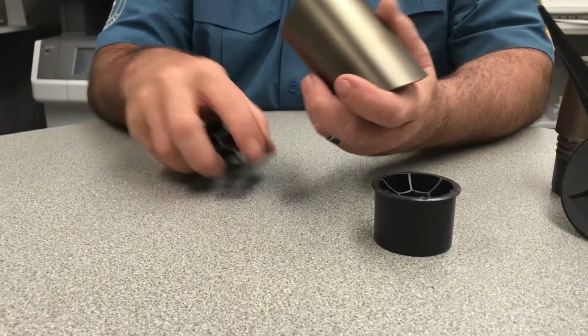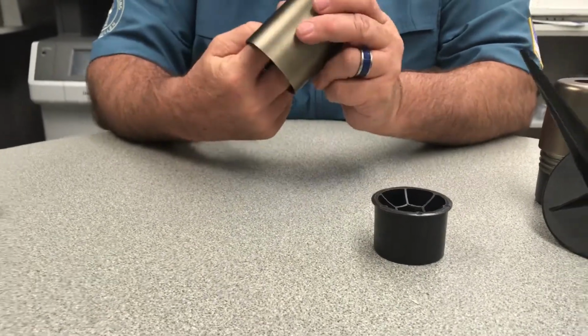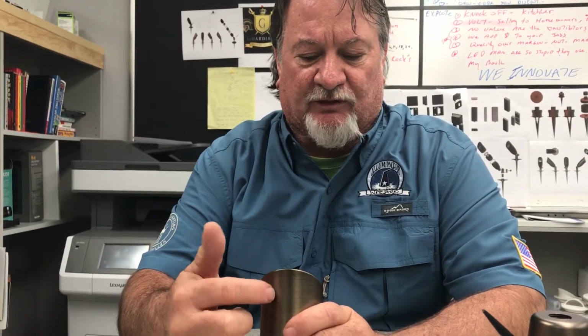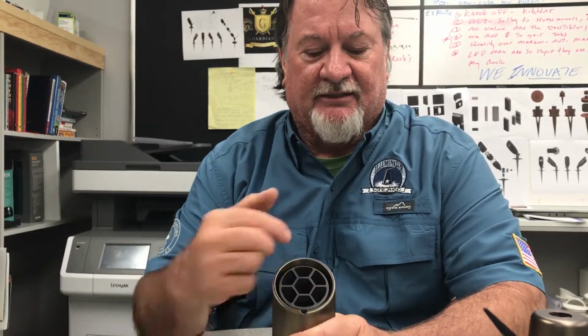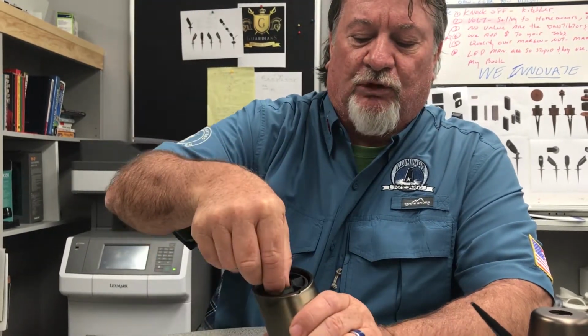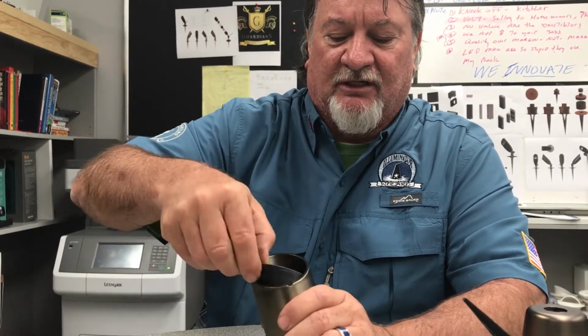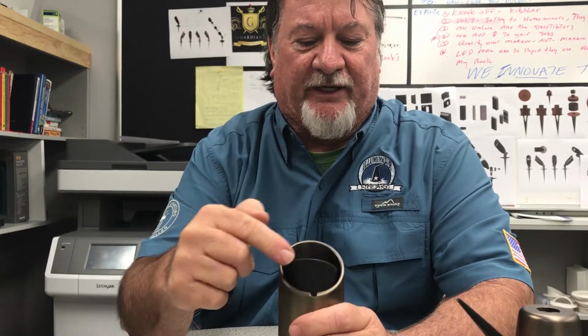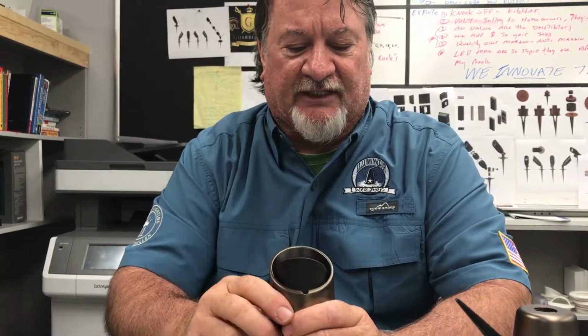A couple reasons why I did that. I'm allowed to sit there and move my hex louver around. Now I've always taught you to put the shroud to the view side. That way you eliminate glare. But let's just say the view side was me. So I've got now no glare because I've got the shroud to me. But you now have glare. So now you can rotate the hex louver 360 degrees. Now I've blocked out glare from your viewpoint and my viewpoint. Only fixture that does that.